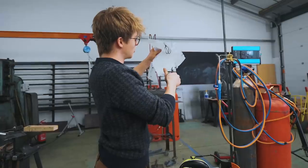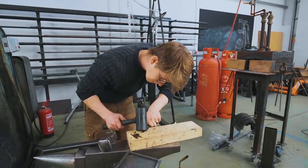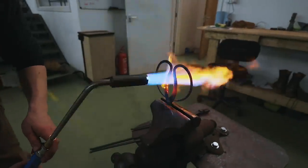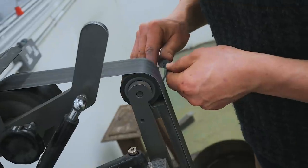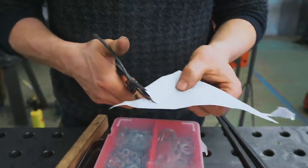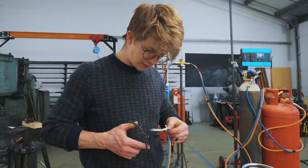I thought we were going to be fiddling for hours. Snip, snip, snip. I think one of these blades though is much too bent — this outer one needs straightening. I want to stop these crossing over so they don't pinch anybody's hands. Time for the secondary bevel. They're cutting into themselves. I've sharpened them and now they're no longer closing the whole way — they stop. They are still not working. Jamie did tell me just leave them how they are about an hour ago. They're cutting now — don't mess with them anymore. I've ruined all my nice work. This is a nightmare.